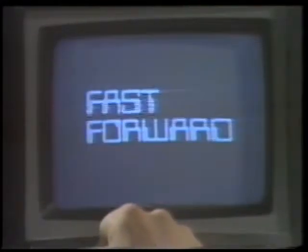That blanked area is that big black bar you see when the vertical hold isn't set right. For this whole thing to work, the scanning in the camera tubes has to be at exactly the same place as the scanning on the home receiver. In fact, all the studio equipment has to be scanning the same spot at the same time, and all the receivers tuned to that station have to be scanning the same place at the same time.